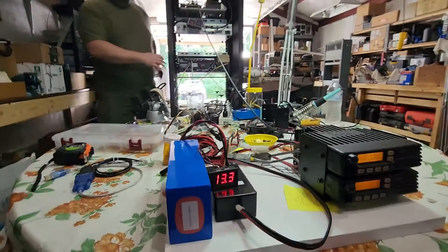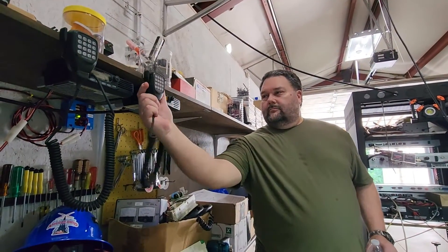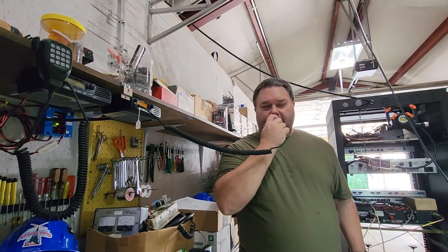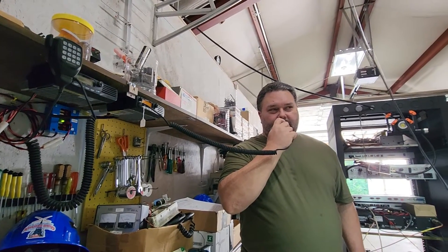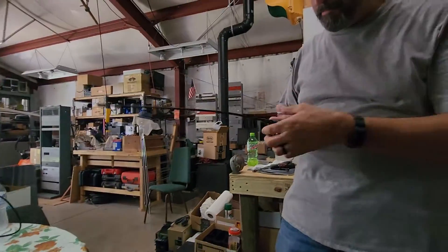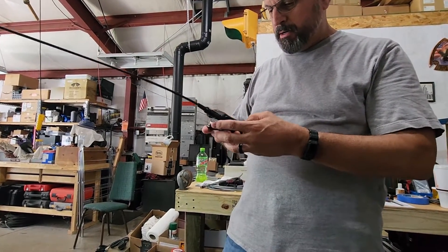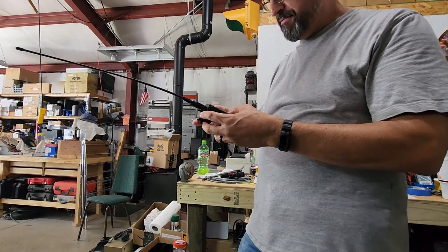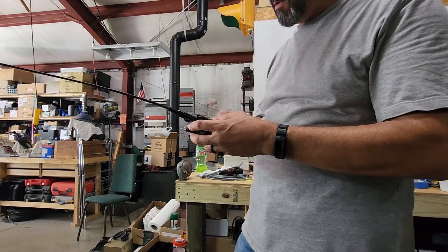KY4CKP is moving over to the two-meter repeater that we're just testing against. We're communicating on two meters and seeing if it crossbands correctly back to the HT — and it was. We just had to make a couple of adjustments on the radios. One of the things we were looking for is how much power is actually being consumed when the radios are actually being keyed up.